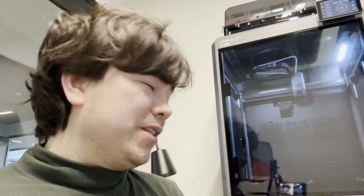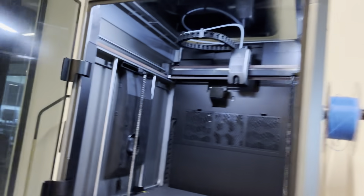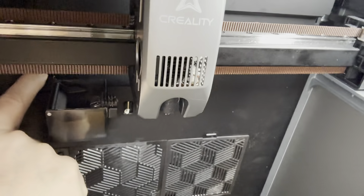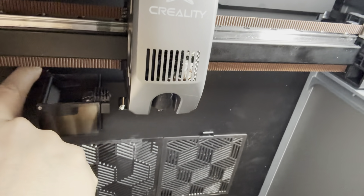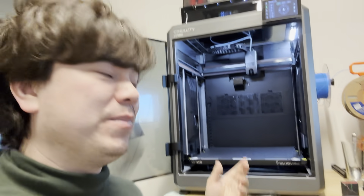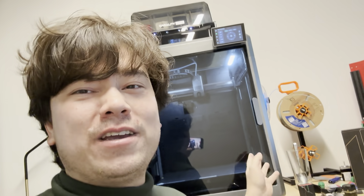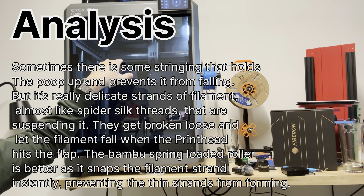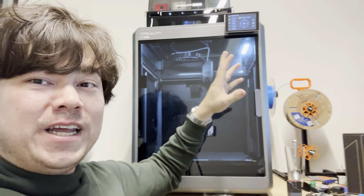The fourth thing that I hate about this printer is the poop system. It's this little system in the back where it deposits the filament, then it hits this little flapper mechanism that's supposed to knock things loose — it comes up and hits the poop and tries to jostle it a little bit to break things loose. It works pretty well, but I've noticed a couple of pieces building up in there. It hasn't directly caused any failed prints for me; I've just noticed that every once in a while there'll be two or three pieces of poop built up before it knocks them down.